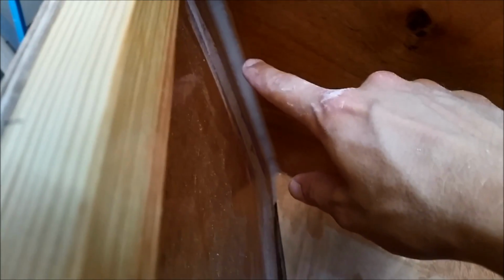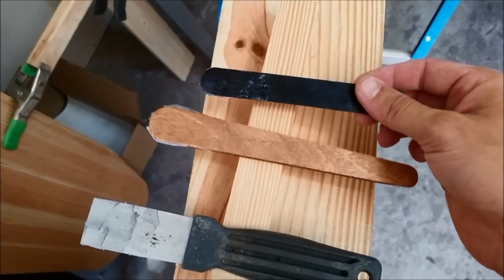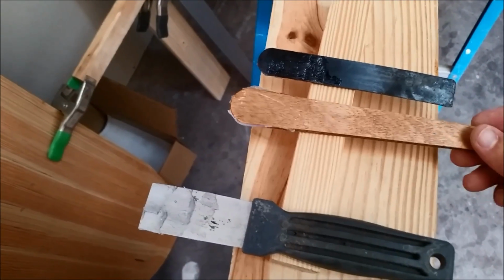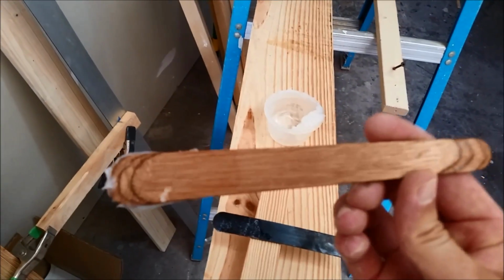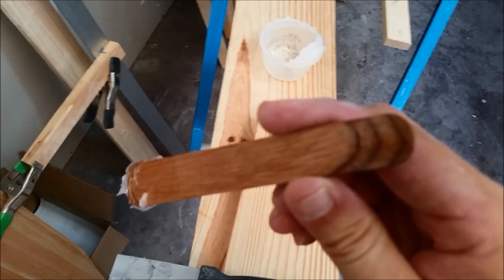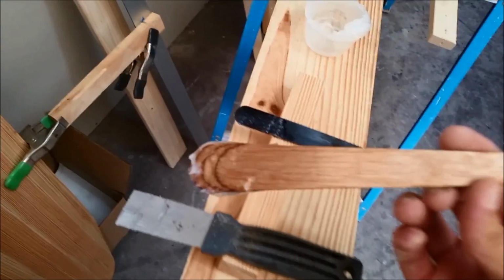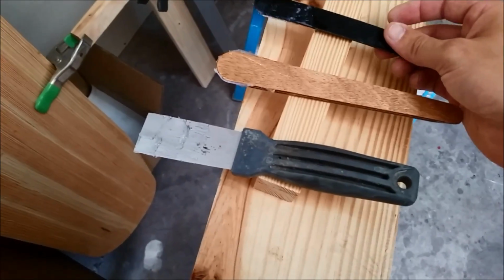And just to give you a sense, this fillet is approximately 5/8 of an inch across from where the radius starts to the radius stops, so that's probably a 5/8 inch fillet tool. And in fact, this is the fillet tool that I used for that, and it's approximately 5/8. This one is approximately 7/8, not quite an inch. I've started using this fillet tool lately. This is one that's supplied by B&B in the kit. And it has a small end which looks to be about a 1/2 inch, and the other end is about an inch. And I probably could have used that, but I had this one laying around, and so I used that one.